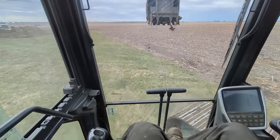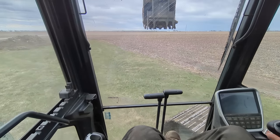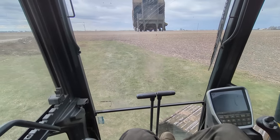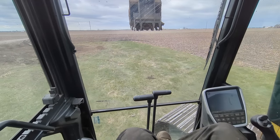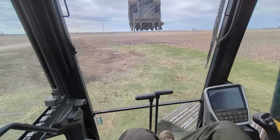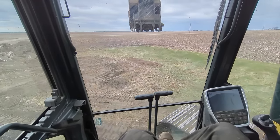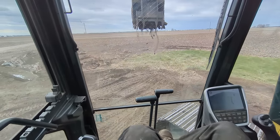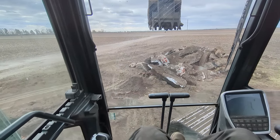I mean, at the end of the day, as long as you're getting production out of that machine, that's all that matters. So what if they're not doing it quite the way you would do it? As long as that machine's still moving, getting things done, that's all that matters. And I know sometimes I'm not the most productive. There are things that I could be doing differently with an excavator, like swinging differently or speeding up my cycle times doing certain things. But sometimes there's just only one way of doing something. A lot of times when we're in wet ground and we can only get a truck to one side of the excavator to load, sometimes you got to swing the long way around to get the project accomplished. That's just all there is to it.